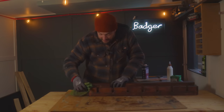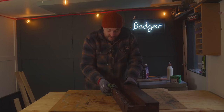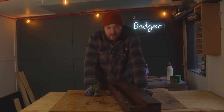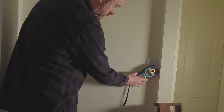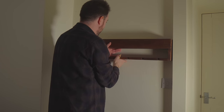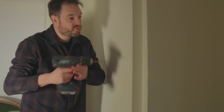So that's all I'm doing on this here. Now I need to go and get it installed. You might have noticed I've not actually come up with any way of attaching it to the wall, and that's because looking at where it needs to go there's a light switch and a cable there, and I didn't take a detector with me so I don't know where the cable runs exactly. But what I have is some keyhole plates — I'm going to take those with me and then I can sort it all out at my mum's house. Back at my mum's, I can look at getting this installed. I've checked the wall and there's no cables to worry about. So I've just got the keyhole plates installed on the back. I can get a level on this and mark out where the screws need to go. Now I can get this drilled, get some plugs in, and get it screwed onto the wall.